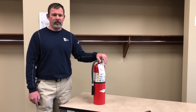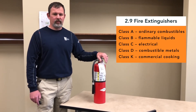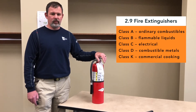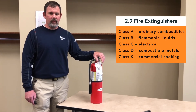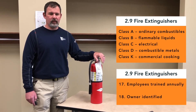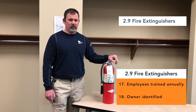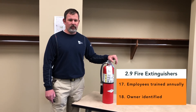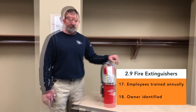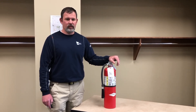Check with your safety coordinator to make sure. Most of the fire extinguishers present in our facilities are typically an ABC type, which can be used to fight most fires. Finally, you should be trained on the proper use of a fire extinguisher annually. We use them to get out of a burning building or to extinguish small known fires. As with many safety items, we need to make sure we have an owner that is in charge of inspecting the fire extinguisher. Now consider the key areas for setting your safety standards for fire extinguishers in the facility.